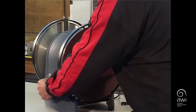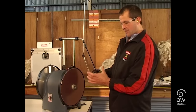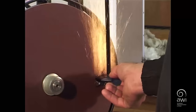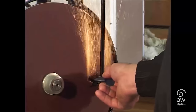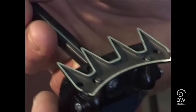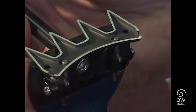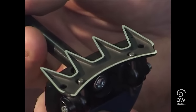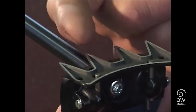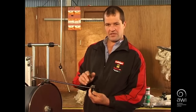Start the grinder up. Because the cutter is a little bit narrower than the comb, we want to use the full width of the disc. Start from the centre and pull it straight off. After finishing grinding the cutter, make sure all the edges are up — the tip as well as down the sides. Use a good white light, roll it around and look for any white edges. Also make sure it's got that little bit of feathering on the tips. If it hasn't feathered, it obviously hasn't ground up to there yet.